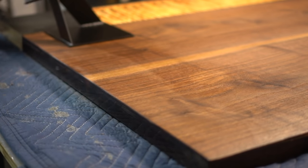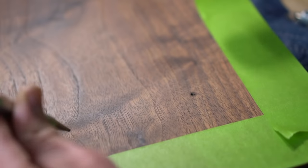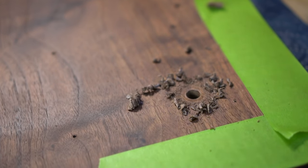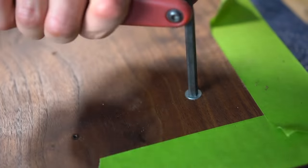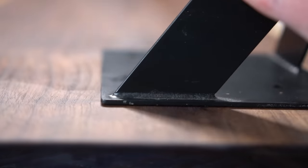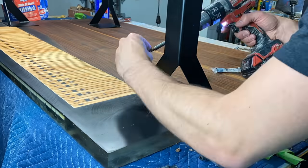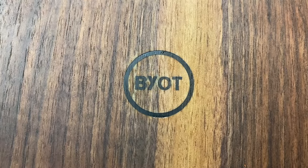For table legs, I picked up wide table legs from Doug Mockit — a really beautiful, unique and simple look with a bit of character from the wide shape. I marked my fastener locations, pre-drilled holes, and inserted threaded inserts for the fasteners — a very professional look and strong fastening method. I use a hex head to fasten them in place. And of course, with this being such a special piece, we brand it BYOT style for the final touch — and we are done!